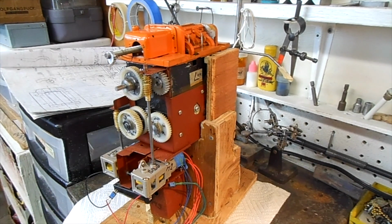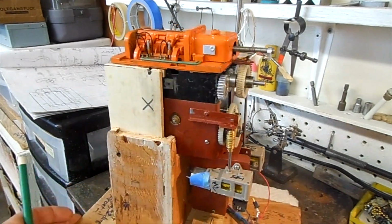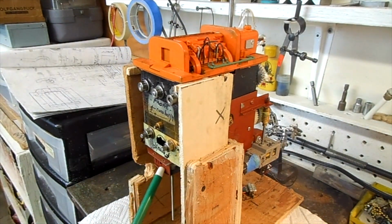So number 1 for the slider. The gear reduction is 58:1, the most demanding drive of all. I have to install a 12-volt DC motor. The number 2 for the flaps, also a 58:1 reduction. Number 3 for the press block, it's an 18:1 ratio, and number 4 at the back here is for the door.